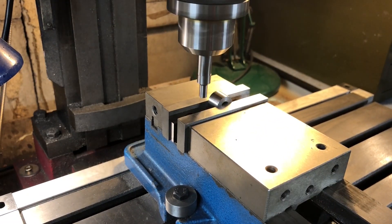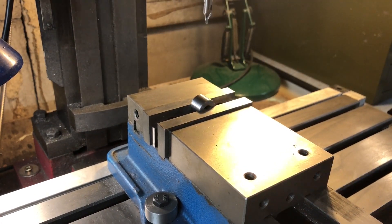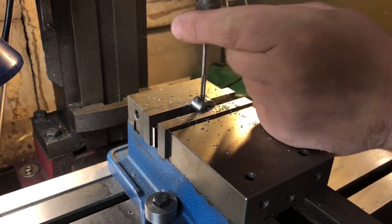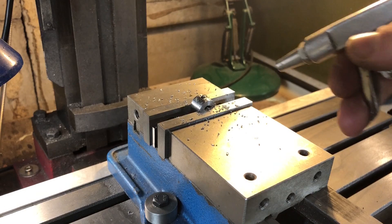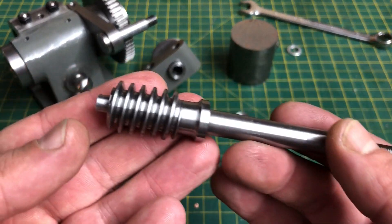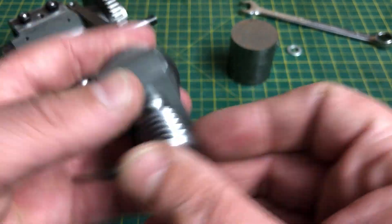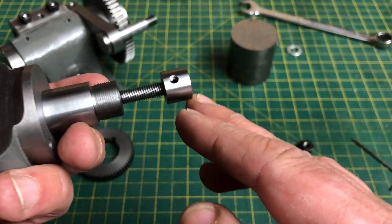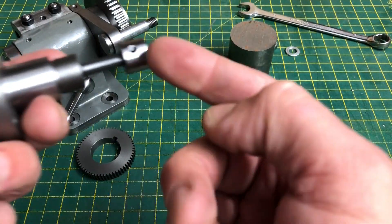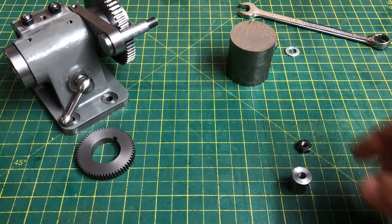With its job as a gauge complete, the collar is transferred to the mill to drill and tap the crosshole. This part will also need features to engage with a slot in the plunger arm but I'll leave those until I have the mating part made. Over at the bench the worm is loctited onto the shaft and it looks acceptable. The fit into the sleeve is good and the collar fits on the threads nicely. As the grub screw will bear onto those threads I've also taken the time to machine and anneal a small copper pad to protect them somewhat.